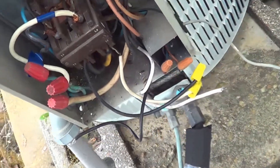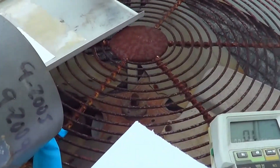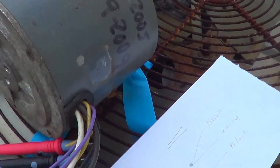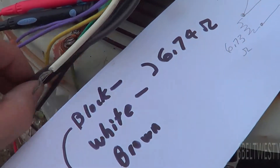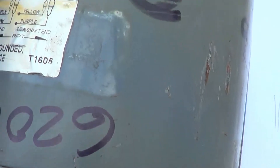Got the disconnect off, good to run the air conditioners here, got no fan action here. So this is a known motor — the winding on here between black to red is 6.73 ohms. I go across here and it's open, so I've got an open winding on the white to black.